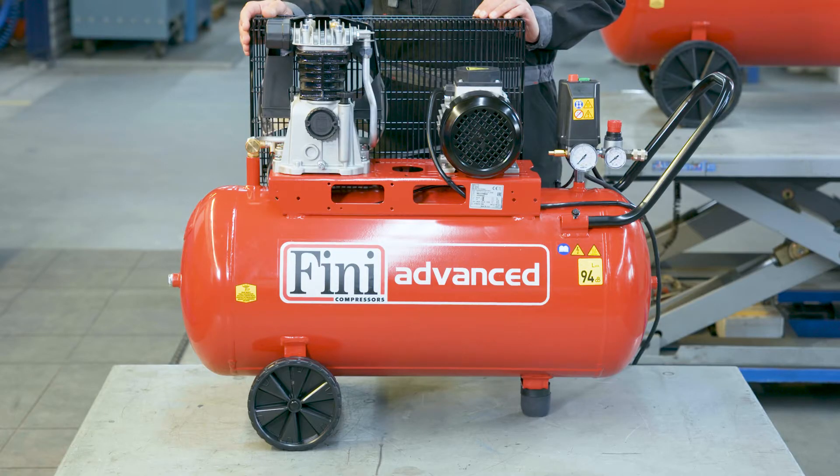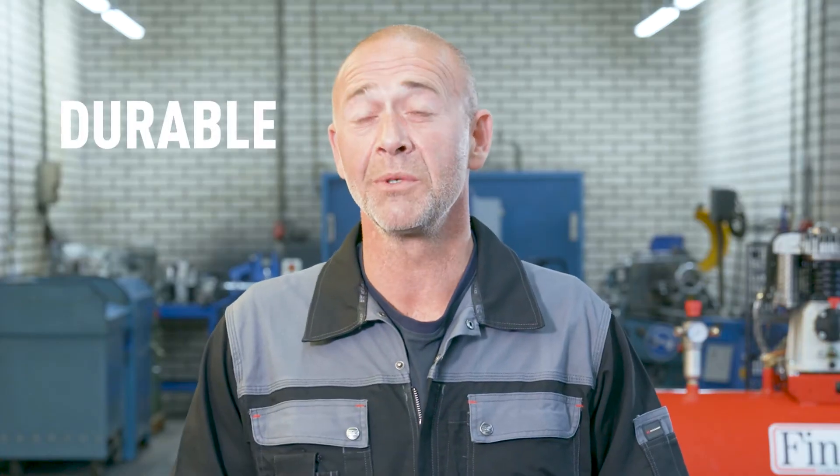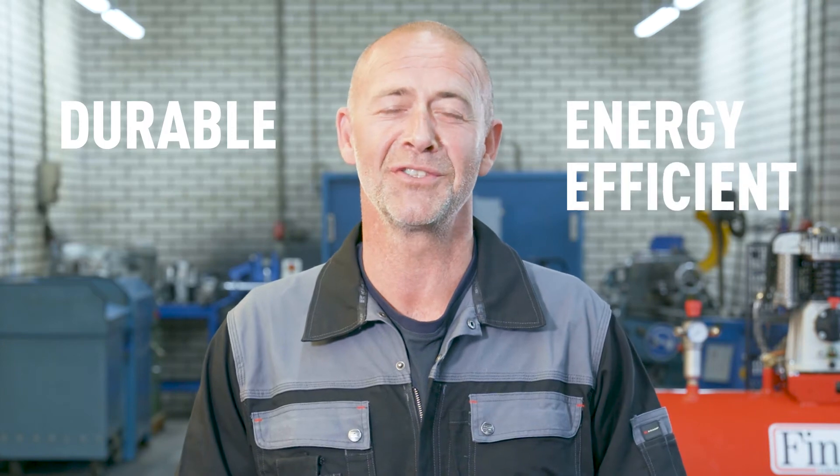Keep in mind that excessive noise is a health hazard and a disadvantage in some settings. I wouldn't recommend using a direct-driven compressor in your garage or indoors. Belt-driven single-stage compressors are, in comparison, less noisy than direct-driven compressors. So if you plan on using yours on a daily basis and near your neighbors, you might want to consider a belt-driven compressor. They're also quite durable as you can replace the parts when needed, and they're energy efficient. So the number of stages in your compressor and whether it's direct or belt-driven are important factors you should keep in mind when deciding which one is right for you.